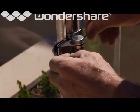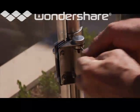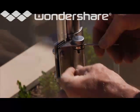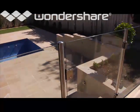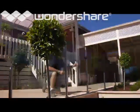Reinsert the tensioning pins into the hinges. Make sure there is plenty of tension in the hinges. Check the swing of the gate to make sure you have adequate tension to allow the gate to be self-closing from any open position.